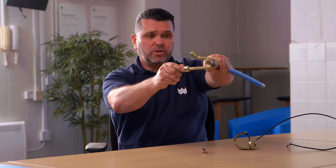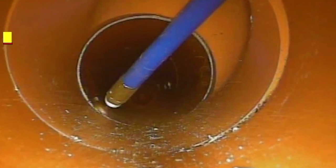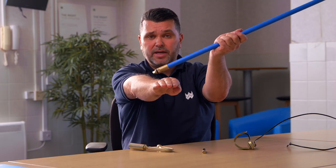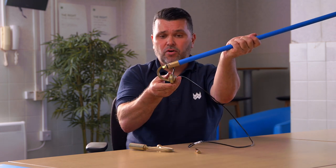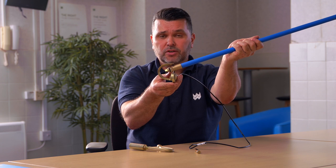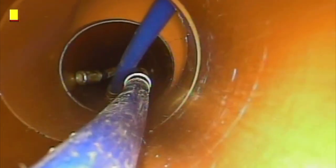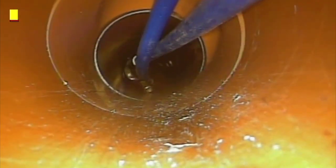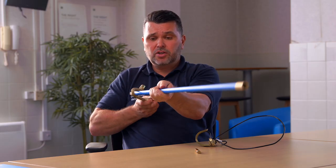The way the crook works: this is your main, and someone's lateral coming down from the main has got a rod going across it. I can't physically get that rod with the noose because it's in the wrong position. I would send the crook down the main, up behind the rod, it will grab it, and when you put sideways pressure on with the handle attached to the end of the rods, you can pull the rod into the main.